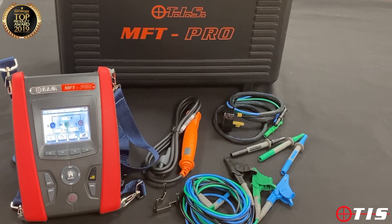The unit will test all standard RCDs but it is also set up to test the new 6 milliamp DC version for electric vehicle charging installations, which is obviously going to be more and more prevalent as the months and years go by.